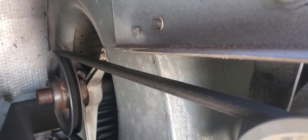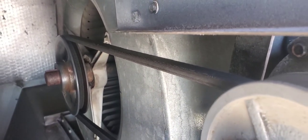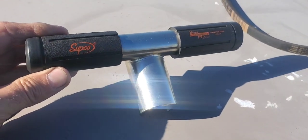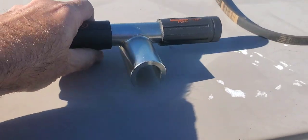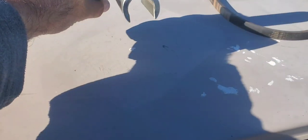The fact that we have some bolts there does help because we can unbolt those and put a puller on and pull it off. But I have something special I want to try today that I've never tried before — this is the Supco bearing buster. It basically gets in behind the bearing on the shaft and uses these handles, once you've lubricated the bearing up, to push it forward.